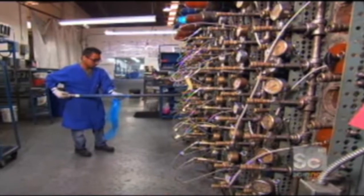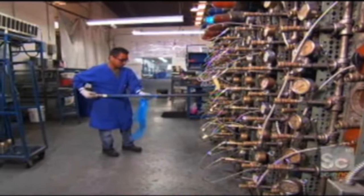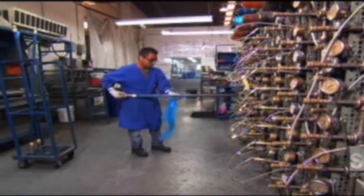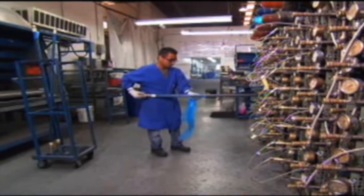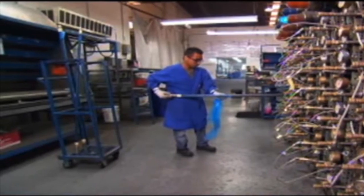Following the layering of carbon fiber, workers place the shafts inside compression tubes which are heated to 300 degrees. These high-temperature compression chambers melt all of the layers of carbon fiber together around the mold. To ensure that the layers are tightly stuck together, a rubber bladder within the compression chamber inflates, resulting in even more pressure being applied to the stick as the carbon fiber sheets melt and combine into one solid shaft piece.